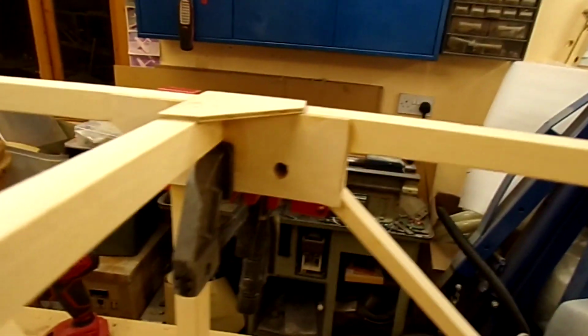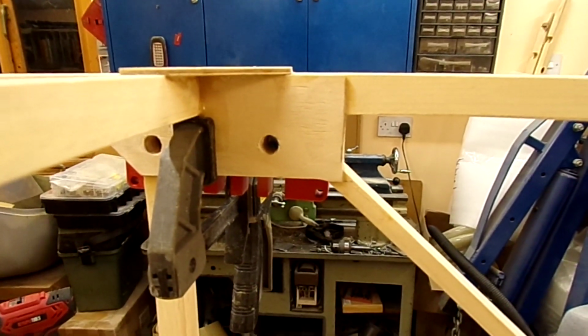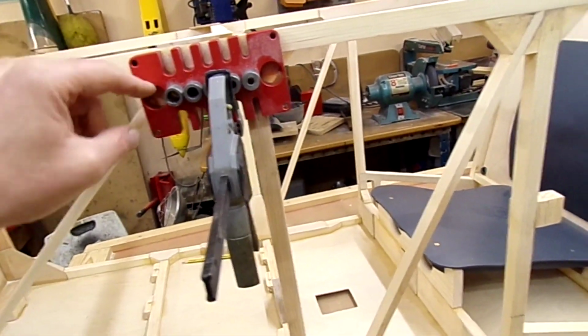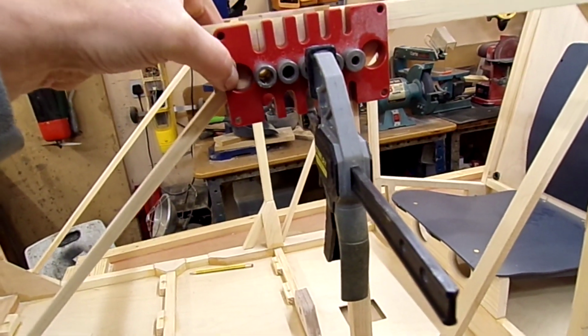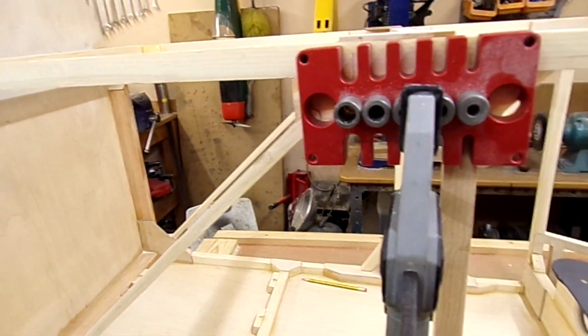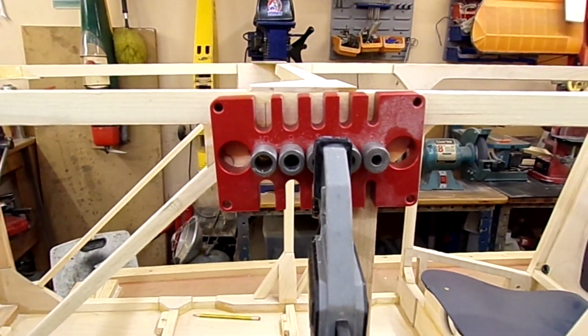It's a stop. Let's see. Yeah, that's made a much better support for the hole, so it doesn't split out. So there we go. They're drilled out to the size for the bushing. I've got some little plywood rings to access the thickness for the skin, so I can put the bushings in. They won't be glued, they won't be bonded. I'm just going to put the bushings into place with the ply ring, so I can actually attach the hardware and see what it comes out like.